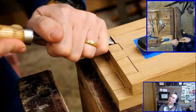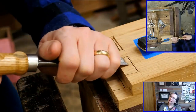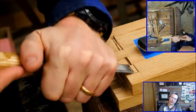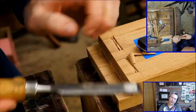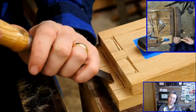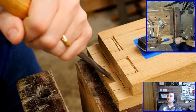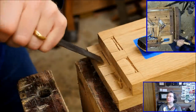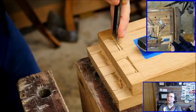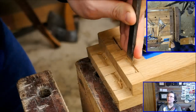And then, here's one problem that a lot of people have. When you chop in, you can come in from the end and pop them in this way, and that goes pretty well. But I like to start and go in at an angle. And so if I start here bevel up like this, sometimes, and I'm trying to make it happen, it's not going to happen right now as the holdfast is holding pretty well, my force is more in line with the board here. And what happens is my force is trying to push this board that way, which the holdfast is not quite as good holding it that way. So what I'm going to do is flip it around, bevel down, and this is going to put my force more down into the board. And this way I can just come in and pop these bits up. And again, if you get good at holding it, so you don't have to set the mallet down, you can go back and forth and back and forth, and we chop in again. And this just repeats the process. Chop in, pare out, chop in, pare out.